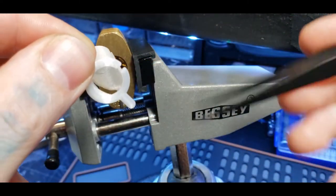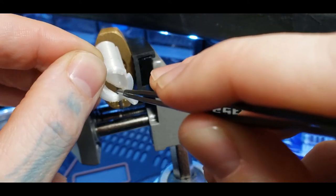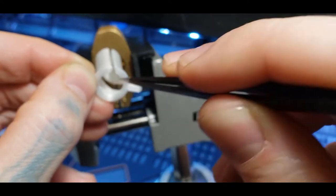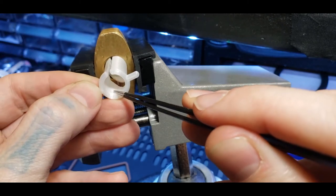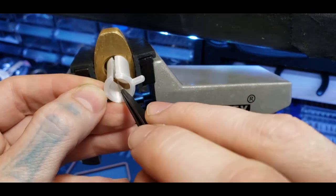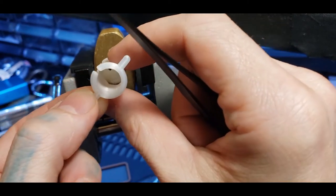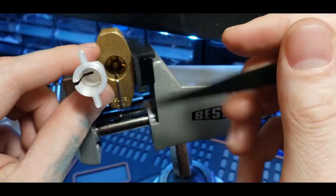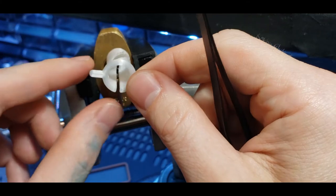The way you do it is you stick it in there. This will expose the first pin hole in the Bible. Stick your pin in, turn a little bit. First pin is now covered, and now the second pin is exposed. Now first and second are covered, third pin is exposed, and you keep pinning that way. You keep turning this, and now you can see the whole Bible will be covered when you're at this point, so none of the pins can come out.